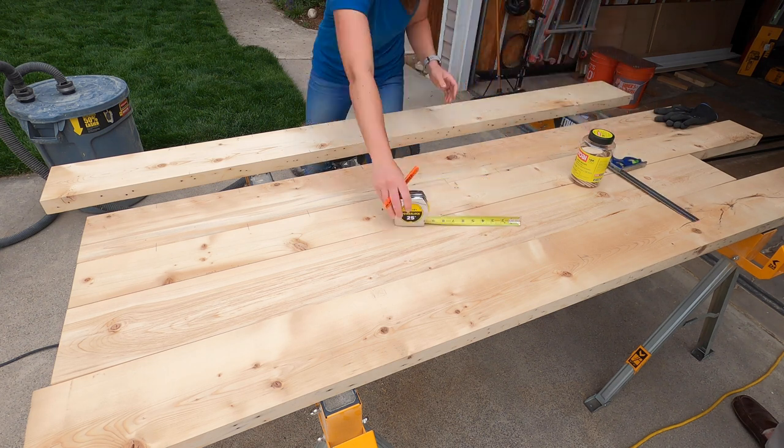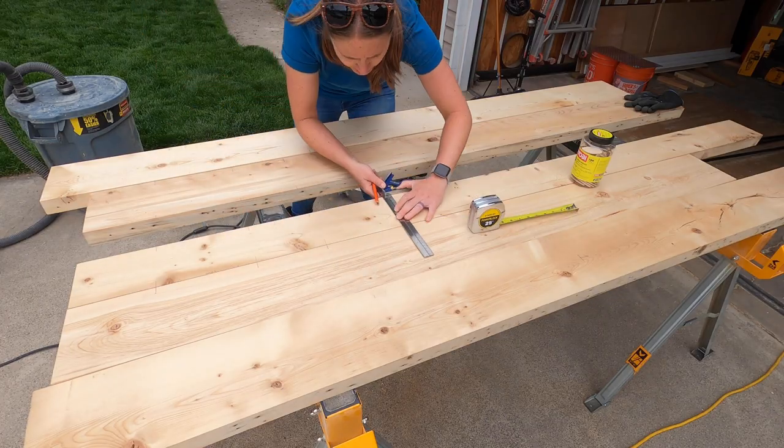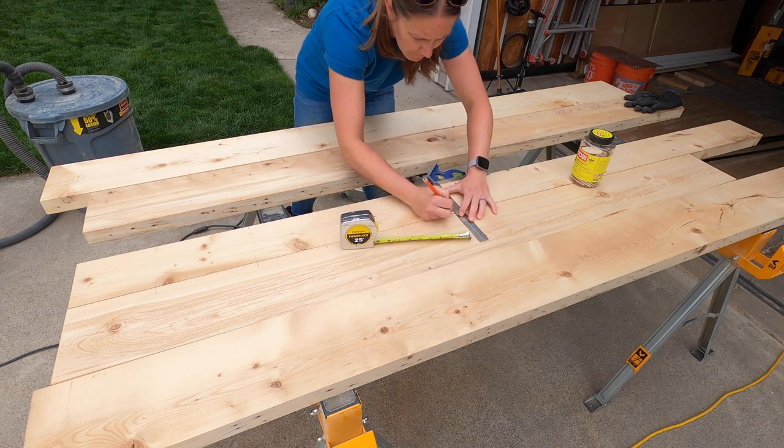After squaring the edges, it was time to attach the boards together to form the tabletop. I decided to use a biscuit jointer to do this. I started by laying the boards out in the order that we wanted them. Something I did not know about when I created my tabletop was the grain arch on the ends of the boards — you want the grain arch to alternate. The Woodworker Journal video linked below has a great tutorial explaining this. We then marked the boards for where the biscuit would be placed, and Eternal Harvest has a fantastic tutorial on how she glues up her tabletops, which I will link in the description below.